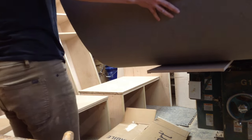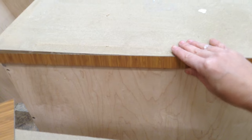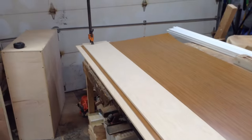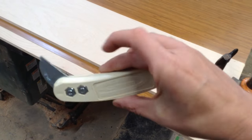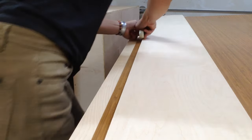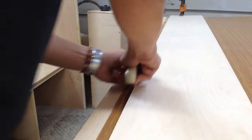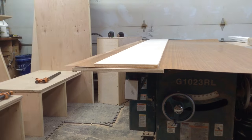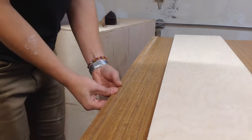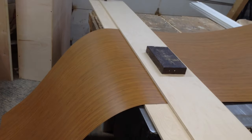For the bench top they wanted laminate. I don't love working with laminate, especially since this was a special-order color — if I made a mistake I'd have to order more. There are two sections to do on MDF. I cut thin strips to make it look like a solid piece of wood — like an edge-grain butcher block — and long strips for the two bases. I use a simple laminate cutter with a plywood straight edge. I score a couple of times and snap it off for the tops and edges.